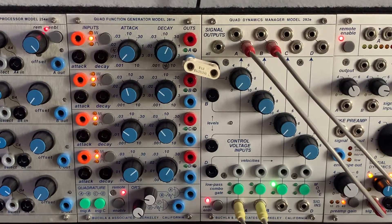You can look at the velocity input as being able to double-gate something — taking two different types of control voltage, like a slow evolving envelope with a pulsing one underneath it, all within the velocity and regular CV inputs on one channel. I use the velocity inputs a lot when performing live with the 223E, using the joystick pads to bring things in and out like a mixer without having to touch the 227E's knobs.